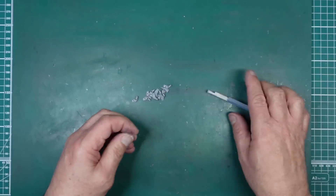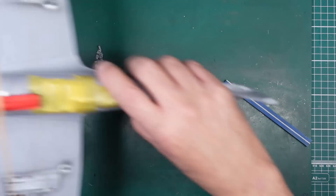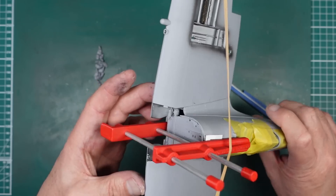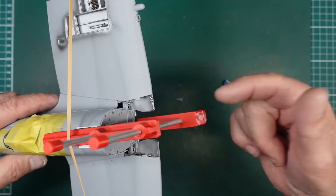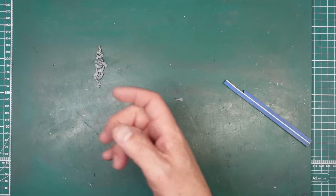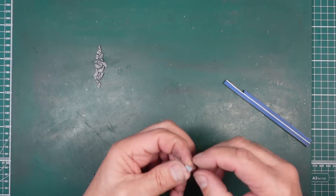I need to leave this about 12-18 hours before I start undoing this clamp, because it's going to want to pull up. We're going to be putting a lot of stress into that area putting all the wing in, so we need to make sure it's good and hard. We'll also go around with a knife afterwards and thin out the plastic wall around the edge — I'm doing it afterwards because I don't want a really soft edge that will mark easily.